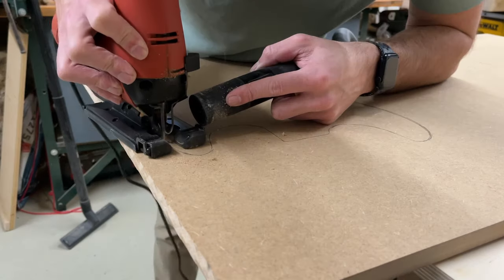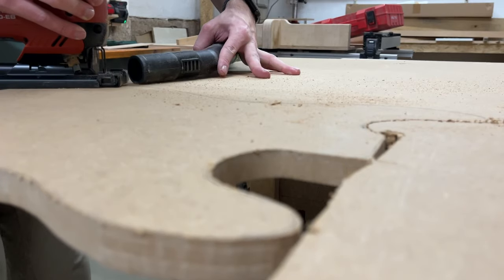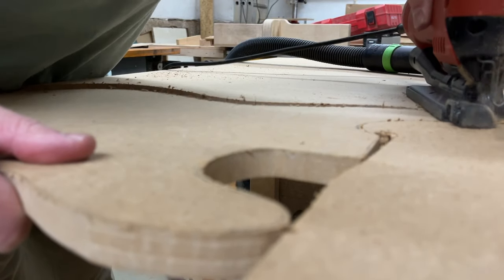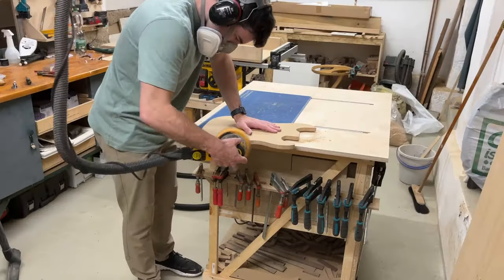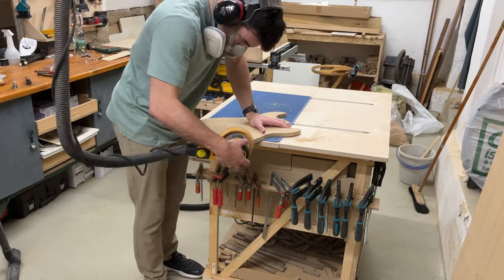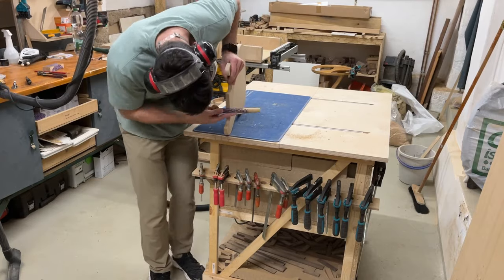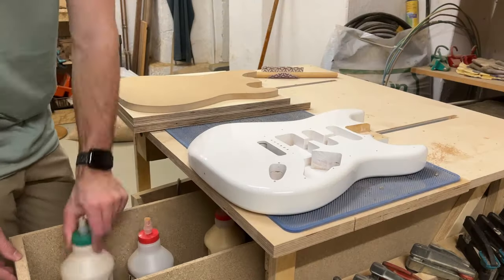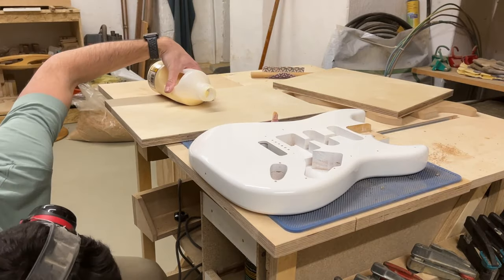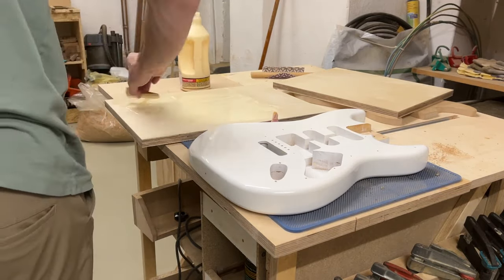There was a simple solution to the first problem. I knew that my father liked the shape of the white guitar, so I used it as a template. I made the template out of MDF, which was easy to work with, so I could later transfer the shape to the hardwood. The second problem is not so easy to solve. Wood works. It can change its size due to external influences such as temperature, humidity, or exposure to light. This is fatal if the strings are to maintain the same tension at all times.